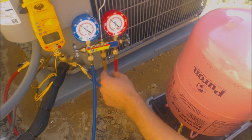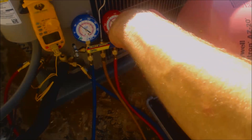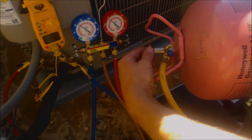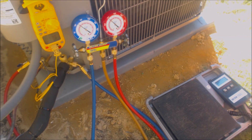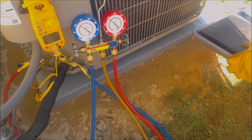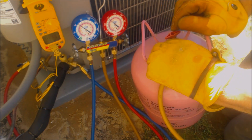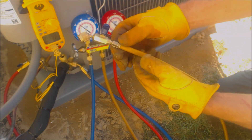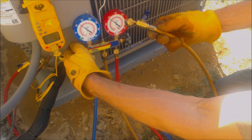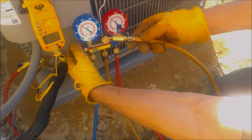I'm going to go ahead and stop there. I'm also going to add a little bit of refrigerant from my liquid line. I'll shut the tank off now and disconnect from the bottle. This service line has liquid refrigerant in it, so I'm going to continue charging — just charging the refrigerant that's in this hose into the system.